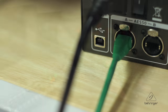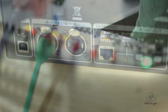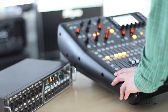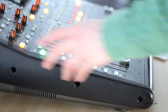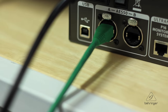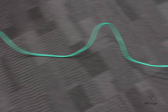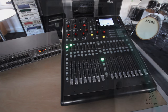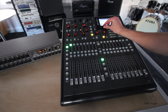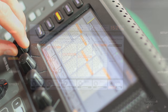Let's take a look at the back. You will notice two AES50 ports. To make use of the X32's full potential, up to three S16 units can be cascaded to allow 48 channels of bidirectional audio. Any AES50 signal cascaded from one S16's port A to another S16's port B is automatically shifted up 16 channels, allowing the last S16 in the chain to transmit all audio channels to and from the incoming AES50 port A.